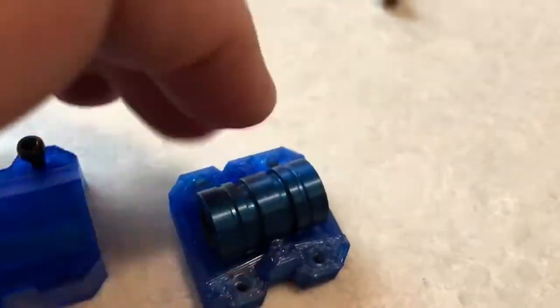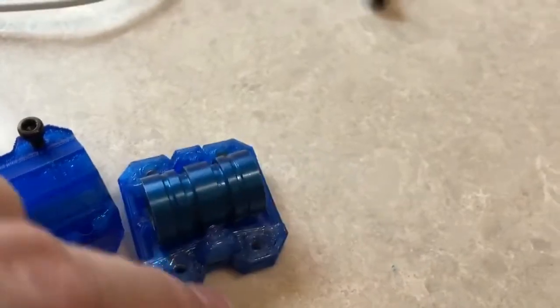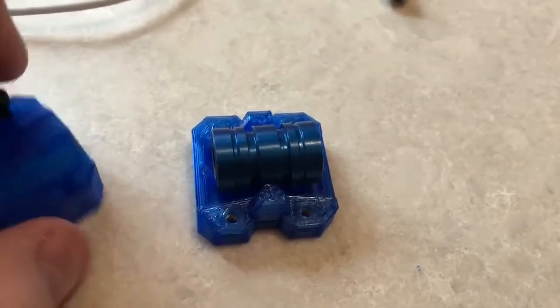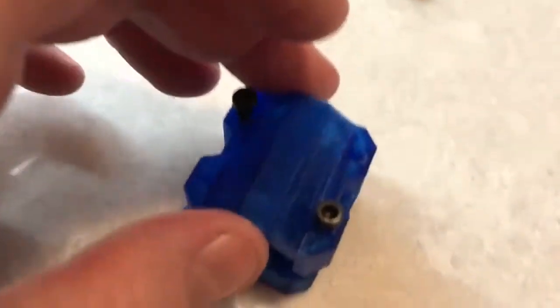Since I can't put the screws in the middle, you screw this to the carriage — three or four screws if you're lucky enough to have a custom bed. Then put all the bearings on, let them self-align, put the cap on, screw it down, and it just clamps the bearing in place.